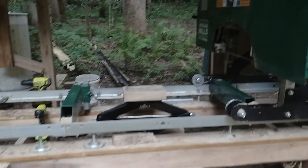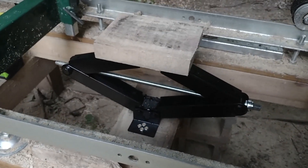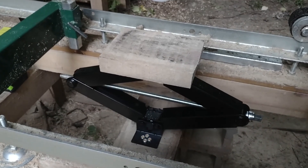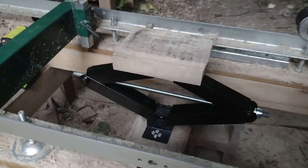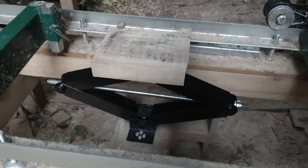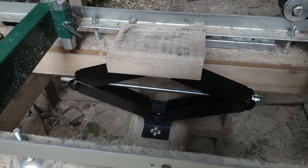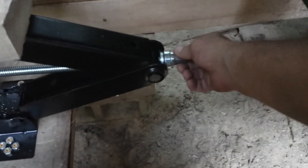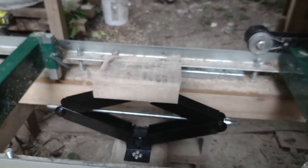The project is finished. I wanted to give you a little top view here — show you what it looks like in its position. You can see the screws down there at the bottom — there's four on each side and I've got four going into the top board. This is a two and a half ton scissor jack. My logs are probably under a thousand pounds, so this is way overrated for that, and that's what I want — I want that safety factor. It's got a lot more height than I'll ever need, but just in case I ever mount this on the ground somehow I can still get quite a bit of height. I did have to turn it with the rails — I wanted to go across the other way but this scissor lift is just way too big to fit in between. I don't think it'll matter at all. I'm going to use an old drill to buzz it up and down as needed rather than the hand crank that came with it, which is designed to reach under a camper.